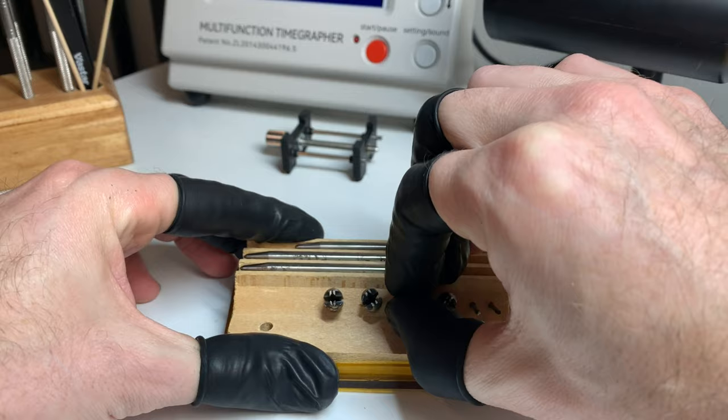The double safety roller design is a common choice for high-end and railroad-grade watches. The roller table has two levels, one that contains the impulse jewel, and the other that is responsible for the safety action, which serves only to keep the pallet fork from moving when it shouldn't. The classic single roller design is not as resistant to going out of action with a shock.